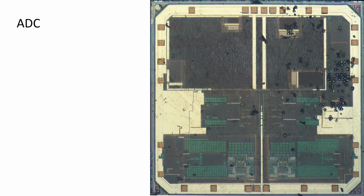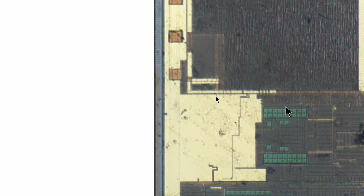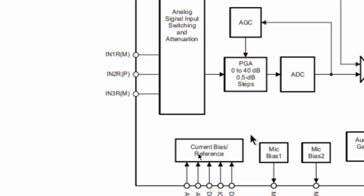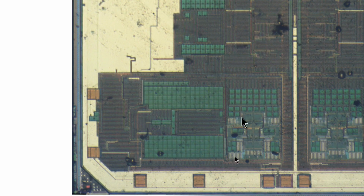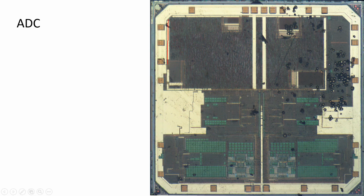And you can see that because if you were to just zoom in, these blocks here are capacitors, and down here you can see some large transistors. Here you can see some large transistor structures, so quickly it becomes evident. It's a digital section on top here. Basically this is the DSP. It's been laid out as a series of gates. The only hard macros you can see, there's one here and one here. I suspect the top here is the ROM, and there's the RAM down here, a scratch pad RAM of some sort.